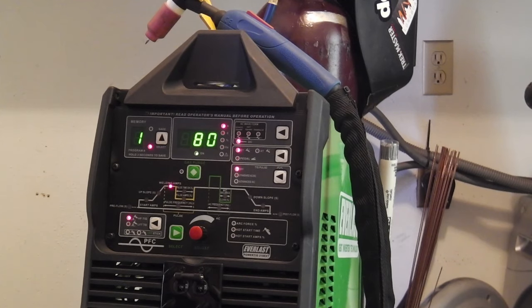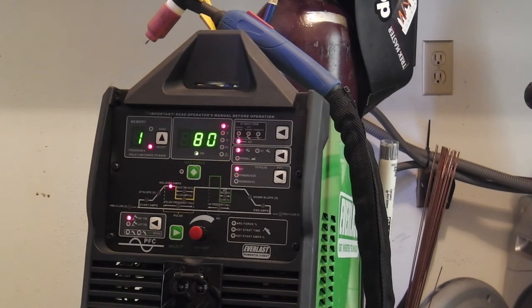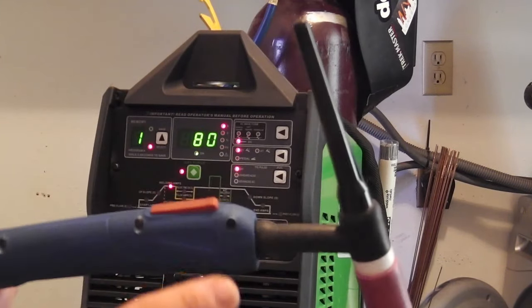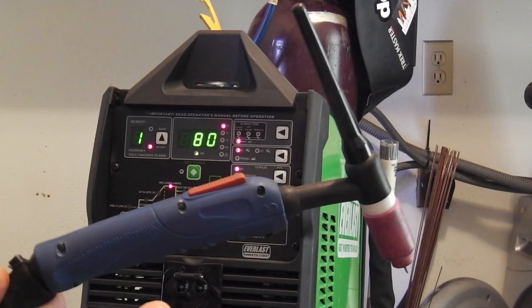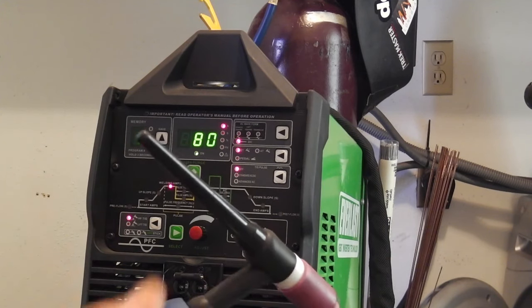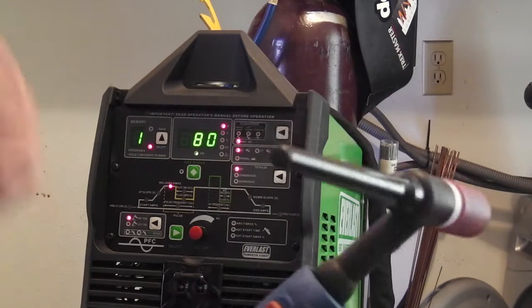That's what I did — I staked the ground out there and I have a quick connect to do that, because my music and my video coming from my computer go out to this stereo and big screen TV. So sometimes when I would initiate the arc, it would interfere with the music being played — only momentarily, maybe three to five or eight seconds, the music would cut out and come back on. I'd rather not have that happen. It only happened occasionally, but I'd rather not have it. So I have that ground going outside, and the high frequency then doesn't interfere.